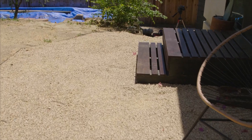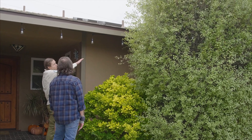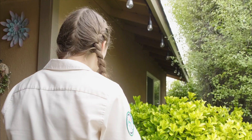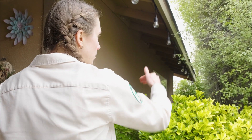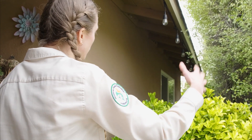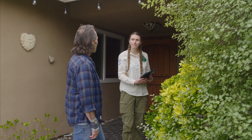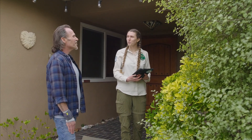It's within your zone zero so I would recommend replacing this bark mulch — it could act like kindling if embers land on it in a wildfire, but you could replace it with gravel or river rock. The next thing I'd suggest is trimming these down and away from the eaves. And the last thing I would do is create some space between each shrub and from the house itself, reducing the overall volume by creating space between the plants. More space, smaller plants — exactly, pretty doable.